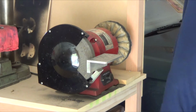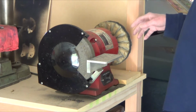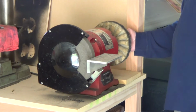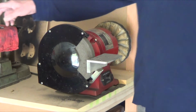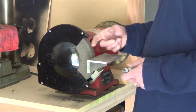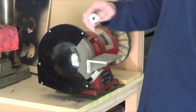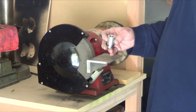This one and the little bitty Harbor Freight guy, 3-inch, I think, 4-inch, for real small stuff. Because this will grab it and throw it across the room and bend it up. I've done that a number of times. So, new buffing wheel. I'll just let this be. But because it keeps wobbling, I've got the dresser to make it nice and round, and it's round and true. But the wobble, so I made a precision arbor that just fits on the back here, just fits on the 5/8.